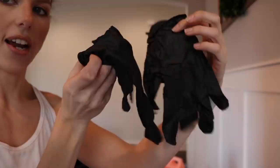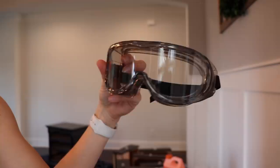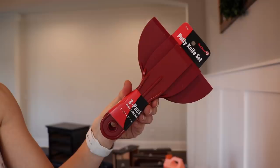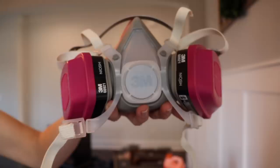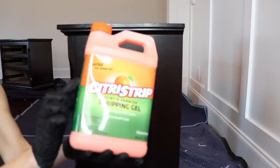We're going to be using this chip brush — just a nice cheap brush we can throw away when done. I have nitrile gloves, heavy duty and chemical-rated so the citrus strip won't eat through them, splash and impact goggles, a three-pack plastic putty knife set, a brass wire brush to get into crevices, coarse steel wool for cracks, a respirator mask with vapor filters, and a plate or cardboard box to catch everything. I have my goggles and gloves on. Take your citrus strip and pour it in a metal bowl — use metal because the stuff can sometimes melt through other containers.